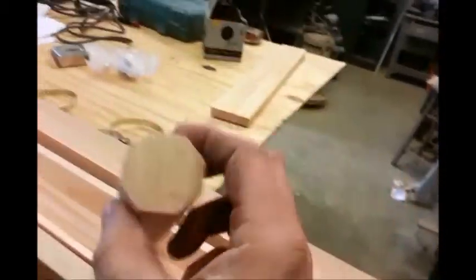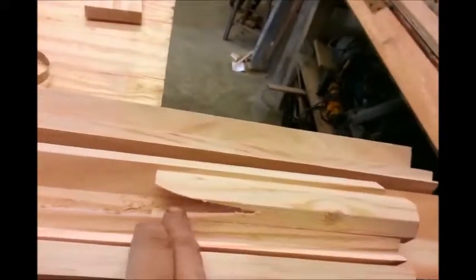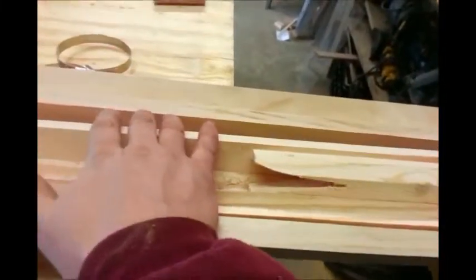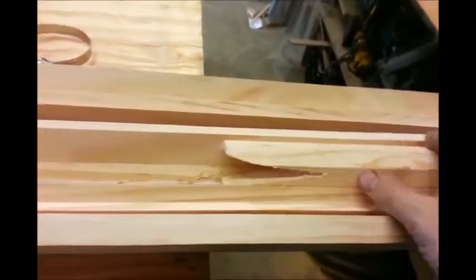This is what we're looking at — it's an octagon piece. It has this V-cut in it here, so the mast doesn't go from suddenly being very stiff to having no extra stiffness, causing a weak point where it'll want to snap. This just allows it to transition a little bit. We've got one at the base where it's going to sit in the mast step, and then there's this one here.